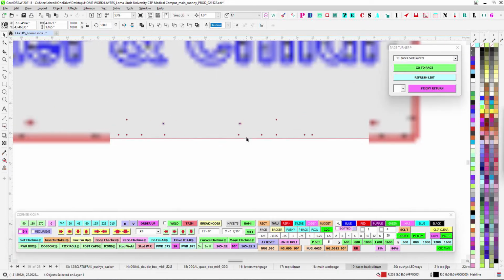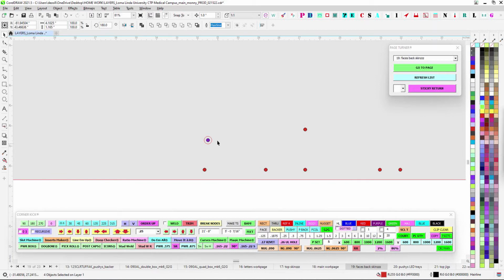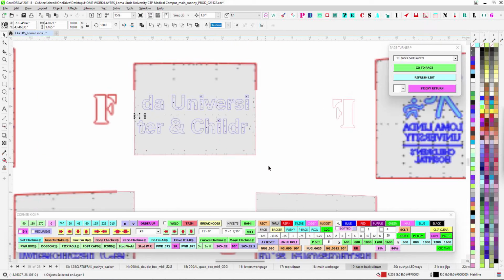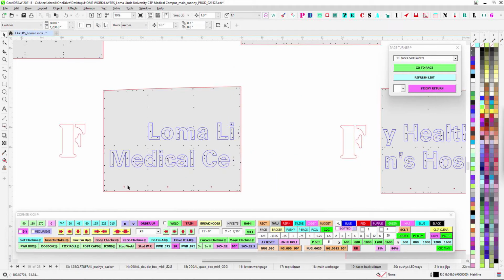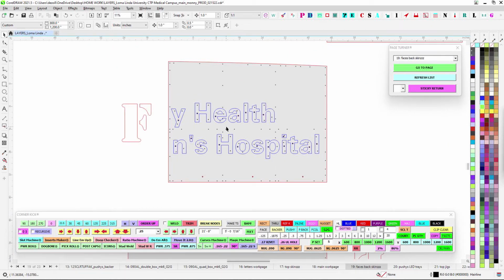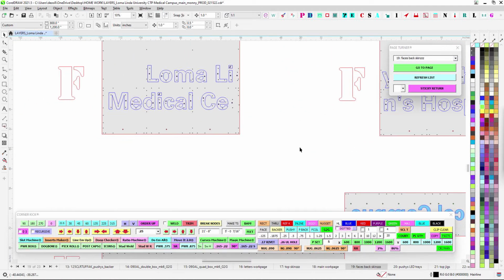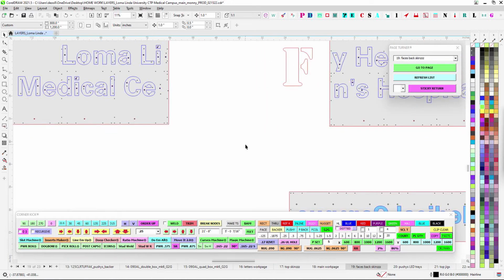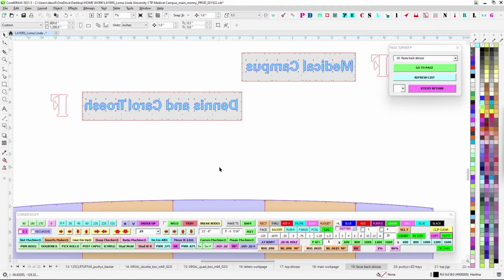These are routed face up, and you'll notice where the light bar goes. Look for reference kisses there. Point out to Prep that we do not want to Bondo those. That's for the middle part here. These are face up, so you'll see reference kiss, reference kiss, reference kiss. That's the light bar. Where all the letters go, make sure they don't Bondo up the 22s. As far as power is concerned, I went ahead and left the power off the light bar on purpose. So make a mental note.